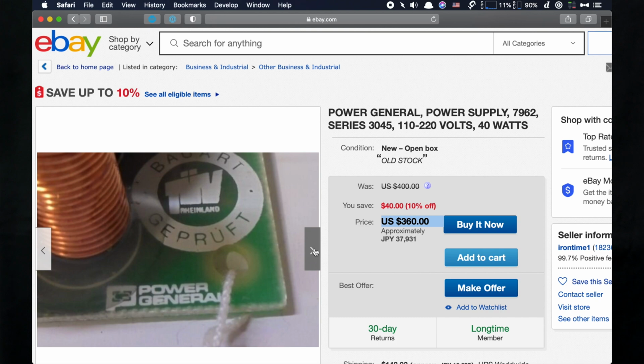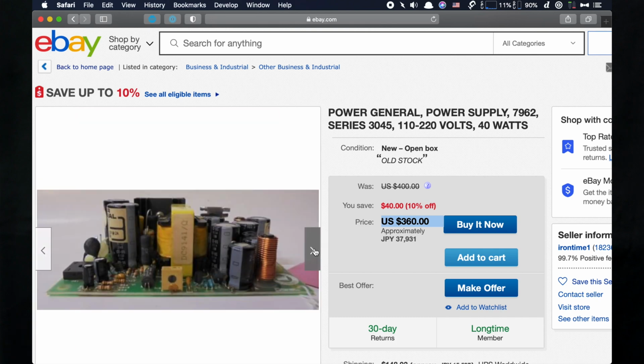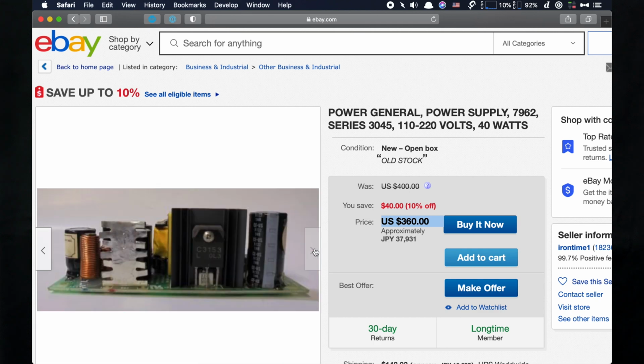Recapping this particular power supply certainly beats buying a new old stock version. I actually found one, a slightly newer model, also made in the 1980s on eBay for a mind-blowing price. And it is true that you can find a more modern power supply replacement, also in the same compact form factor, which puts out 5 volts and 12 volts, many times at a higher current rating than the original.